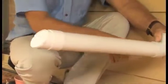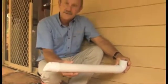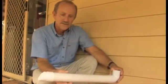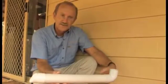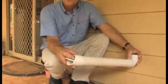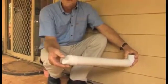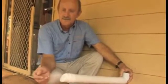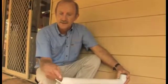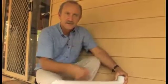So there's no actual bend or trap like in the bathroom floor waste gully we saw earlier on. It's quite a simple process. It's dry, there's no bend, there's no water trapped in there. It should have that flap on the outside. That flap will allow water to run should there be a flood, or there should be a drain required, but it'll also stop insects or mice or snakes perhaps going back up inside that and perhaps coming out inside your laundry, inside your bathroom.